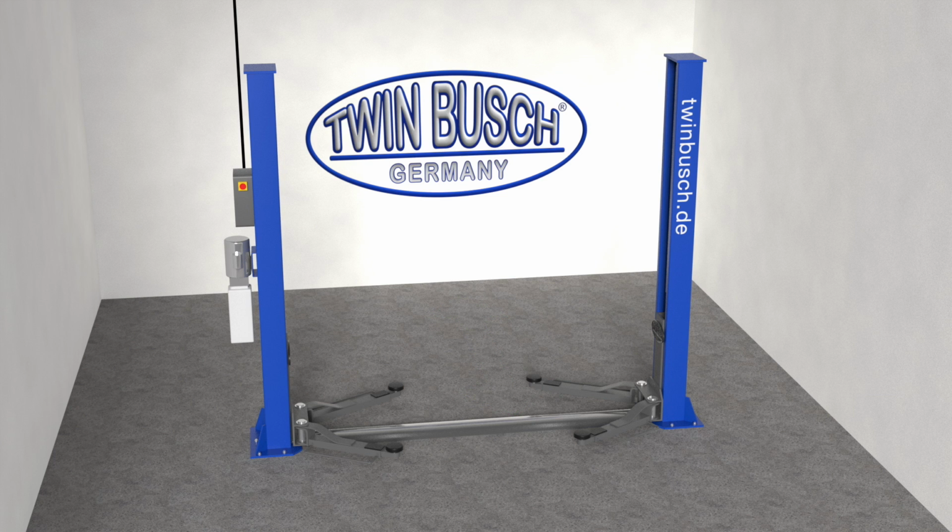The positioning of the main column and secondary column play no role in which direction the vehicle may be driven onto the lift. This is determined by adjusting the position of the long and short carrier arms. You can change the position of the carrier arms to change the direction at which the vehicle may be driven on the automotive lift at any time.